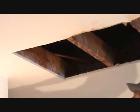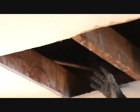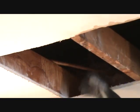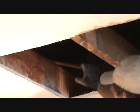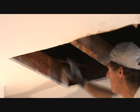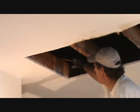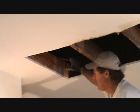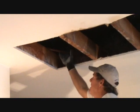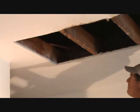Here's another tip for when you're walking around and crawling around up in an attic. If your insulation is blown up too high and you think, 'Oh, I know where the joists are, I can walk there,' you've got to be careful of things like this that protrude in your way. The last thing you want is to put your foot on there halfway off, or kneel down wrong, and all of a sudden you bend one of those pipes if it's flexible piping like this is. So be careful when you're up there in the attic.